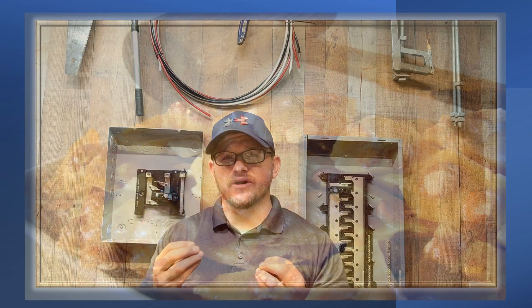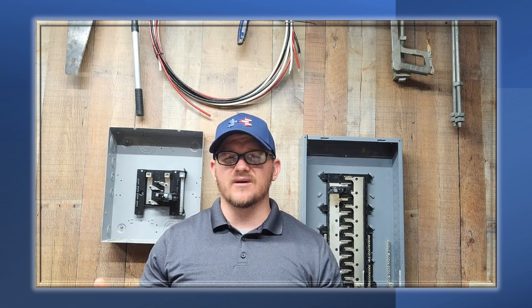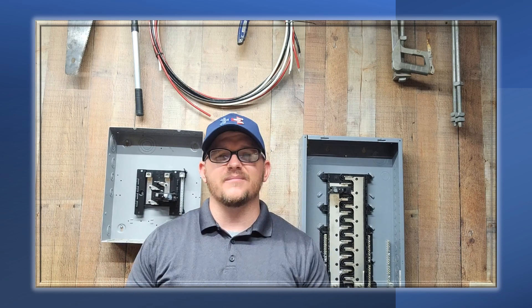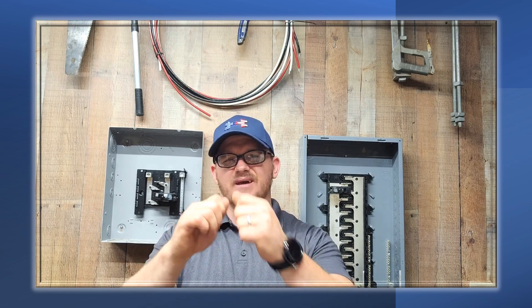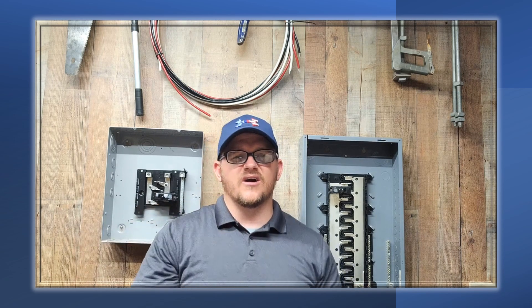The first problem is that it's brittle — it's very soft. You can take it, bend it back and forth and snap it. You could take a piece of 12 gauge copper and bend it until your face fell off and it's never going to break by hand. But aluminum, no problem at all — it's very weak, very brittle, easy to smush. We're going to talk more about that in a minute.